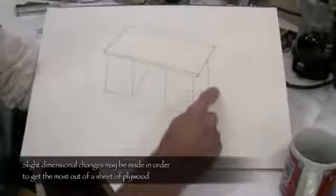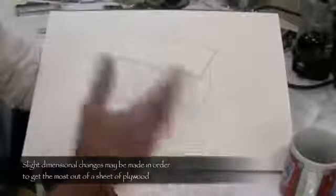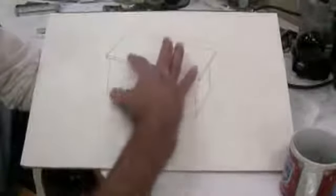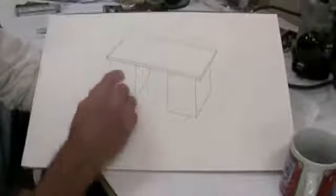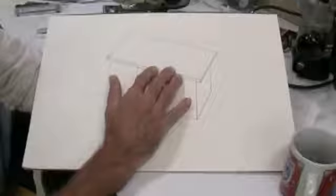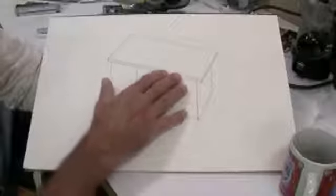Each pedestal will be 24 inches wide and 26 inches deep. That'll leave me a free space in the middle of 28 inches - plenty of room to slide in my stool, get my legs underneath, and do comfortable work. Each cabinet will be 33 inches high. The casters I'll be using are 3 inches high, which gives me 36 inches. The top will nominally be 2 inches thick, so I'm going to have about a 38-inch overall height, which is pretty close to what this bench is and I've found it comfortable for drawing and assembly.